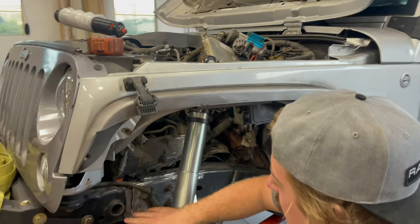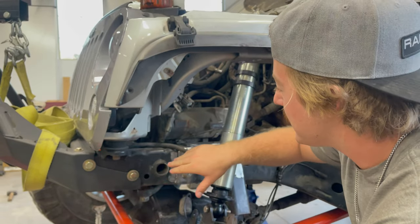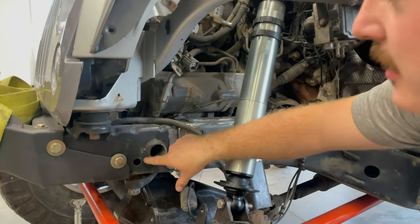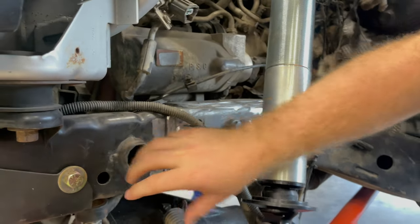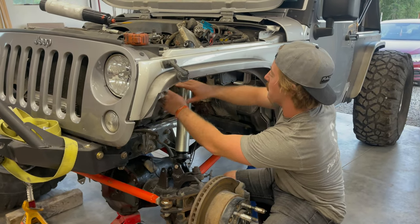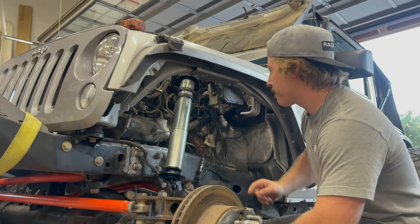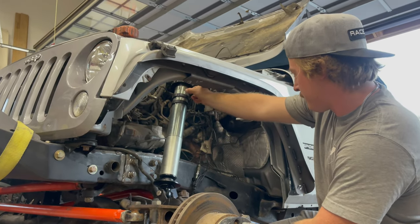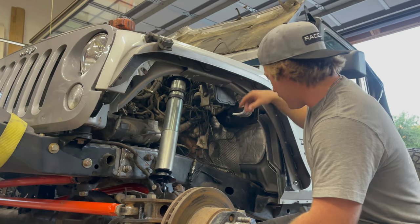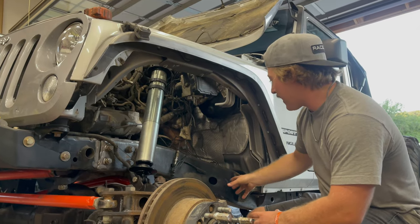Show us what we're doing here. Luckily, this piece right here is about inch and three-quarter, so our piece of two-inch tube will slide right over that and hang out about this far. Then we'll take the top of the shock hoop and go from right there — up, over to catch the shock, and then way down, and then down somewhere in this vicinity back here.